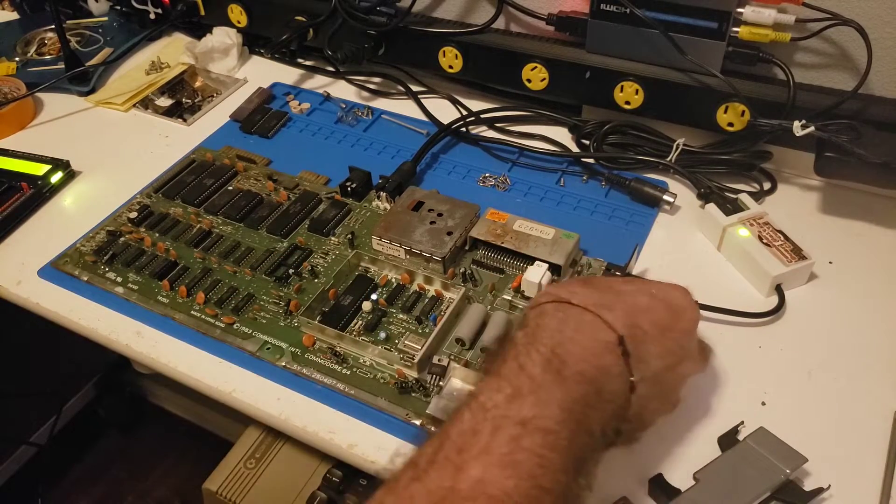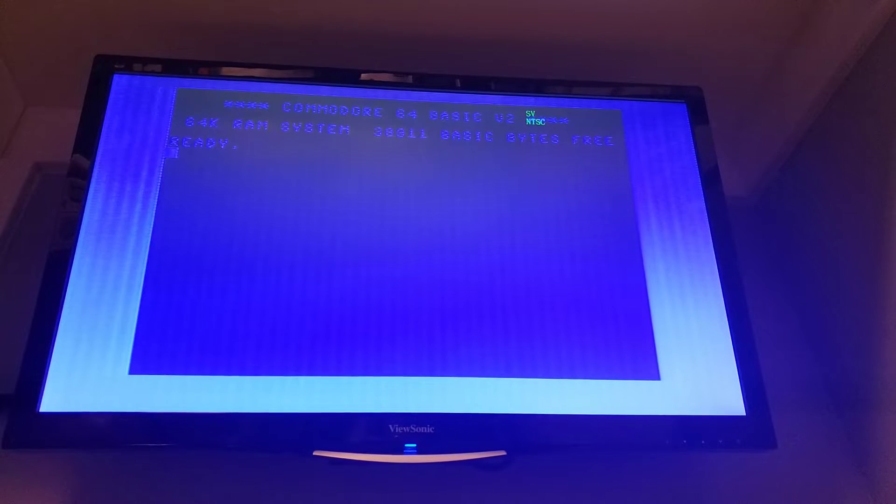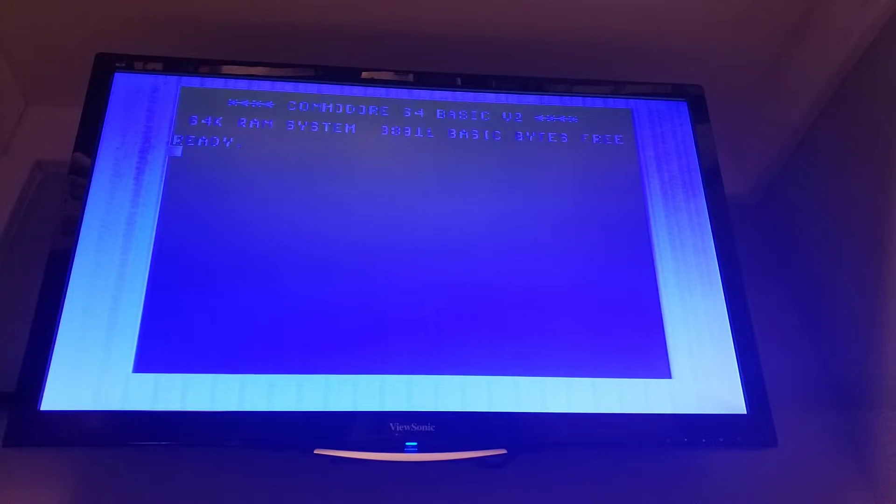Let's test our SID again. Remember that we tested the VIC-2 as bad on the tester, but let's go ahead and replace this VIC-2 here real quick with the original. We'll get lucky, because sometimes it's just reseating. I turned it on — you see! Never trust the tester completely. It was stuck on loose — it failed initially, but I think maybe the pins weren't seated.